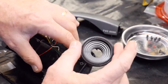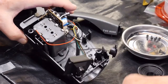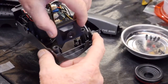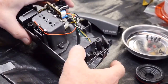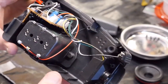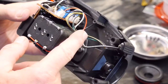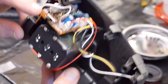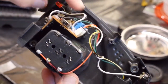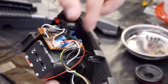I'm going to pop this thing apart and lay it on its left side — the left body shell comes off. This little ring around the sensor lens is just a fake focus ring; it actually holds the lens cap in place. Here's the sensor — it fits into a little slot molded into the front of the camera. This is the microphone; it fits into a little slot. The wiring harness for the microphone and video wrap around each other for noise reduction to prevent 60 Hz hum in the audio, and it goes to a little analog circuit board with your power switch and red LED.